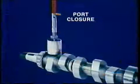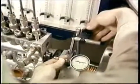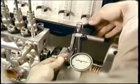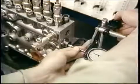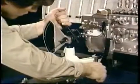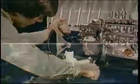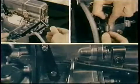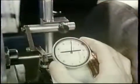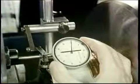Set up to test port closure. First, bring your rack gauge into place like this. Adjust it so the magnet touches the rack. Fasten your protractor against the control lever. Move your stops clear — the high speed and low speed stops and the shutoff stop. Pull the rack full back, and with some preload, zero the gauge with the outer ring.